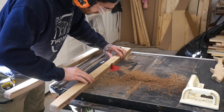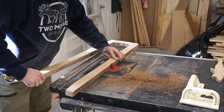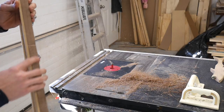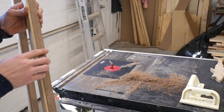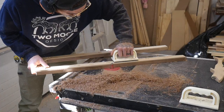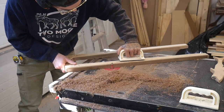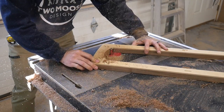This part is a good reminder to always use push pads. Luckily nothing serious happened, but one of the legs slipped off, leaving a big gouge — which we're going to show you how to fix in a bit. That's also one of the reasons I love woodworking: errors come up and you just need to figure out how to solve the problem. We're taking nice slow passes with the flush trim router bit — all these clips are sped up, so I'm not going this fast in real life. Take your time, use your push pads, and just work your way around the piece. If you're not comfortable, possibly take two passes.